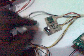Instead of that one, we're now using the digital compass. The digital compass is what would regulate or maintain a heading. So when there's a deviation from the desired heading compared to the reading from the sensor, it should try and actuate the servo, which we'll come to in a minute. All of them are connected via this thick wire, as you see, and it goes all the way to the microcontroller IO pins.